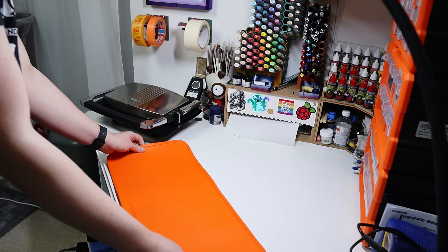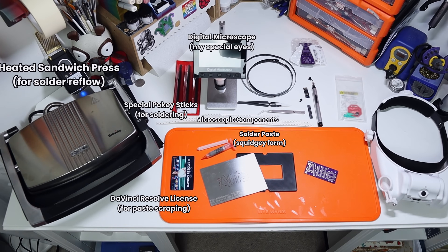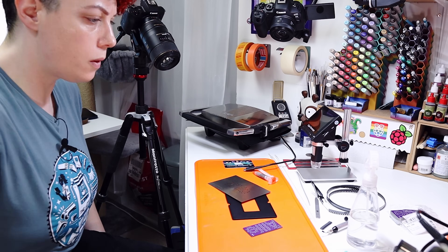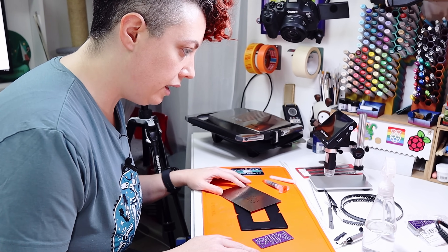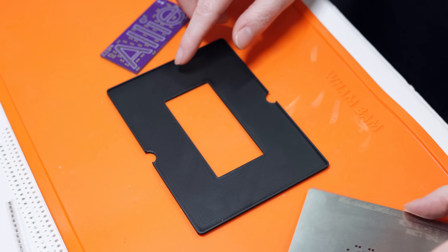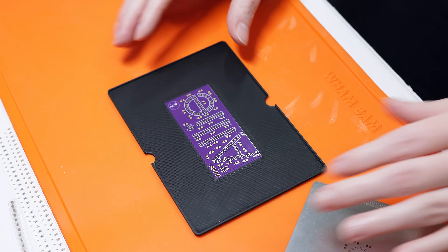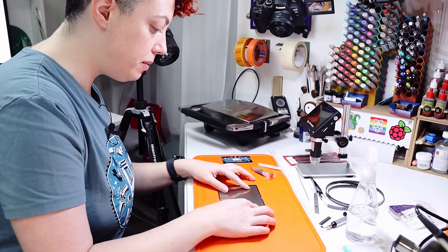What? This is fine. Let's get things set up. Okay. This isn't so bad. This looks reasonable. I feel like I can do this, I think. Clearly the reasonable first step here is to apply solder paste. I prepared for this — I designed a little jig so that I would get perfect alignment. The way it works is pretty simple: the board just kind of pops in, stencil just kind of goes on top. This is actually dead easy, and will probably also be the last thing that is like that.